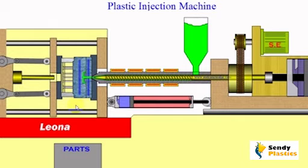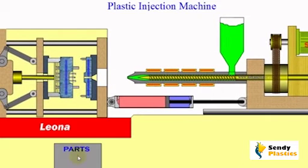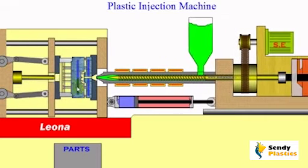While the mold is opening, the shorter push pins push the part and the part is ejected into a part collector. The outer pins are used to make sure that the pin plates move properly.